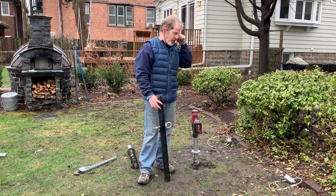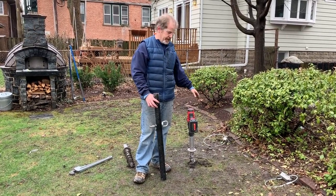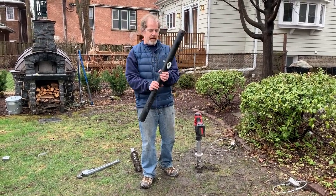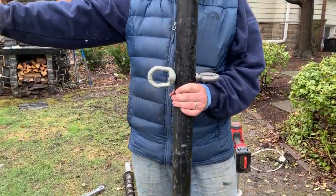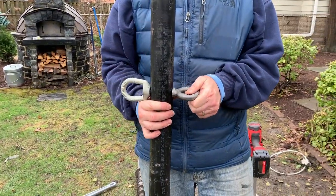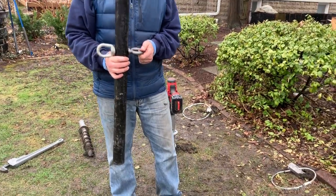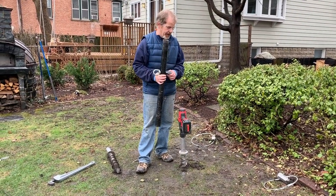We're at the point where I've buried both guys. We've got a two-inch pipe here with an eye nut that's going to face the tracker sled, and an eye bolt which will take cable slings from both guys. The idea is that this will go over the post after I bury it. We'll next work on getting this rigged so we can pull the tracker sled in this direction.